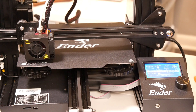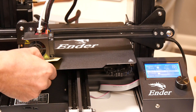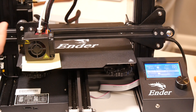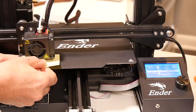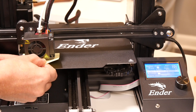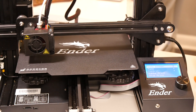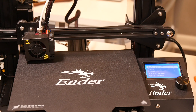Moving to the first calibration position — and you heard that tone, which means it's ready for us to calibrate. The printer is still on; the print bed has been heated to 40 degrees. I chose 40 degrees because it's warm enough to impact the calibration, but not so hot that it will burn you. However, the print nozzle is hot, so you do need to be careful. It says 'wait for user' on the front panel. The technique I've always used is a post-it note. There are springs under the bed, so we can press down slightly and see if we can move the note underneath. I turn the knob to adjust — righty tighty, lefty loosey — until the resistance feels just about right. Then I press the button to let it go to the next position. You'll notice it lifted the print head 10 millimeters up before moving, in case the bed is really off, to make sure it doesn't scratch the bed.